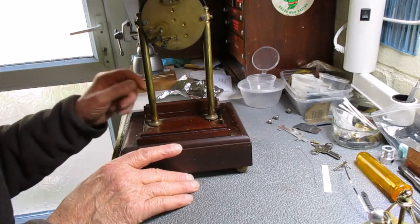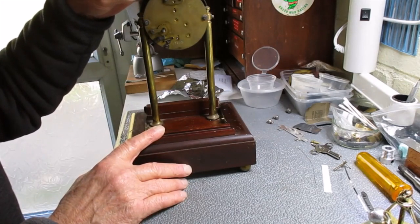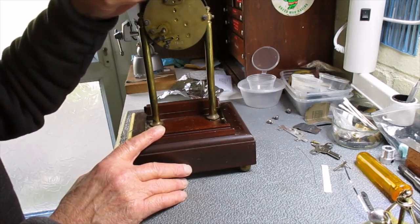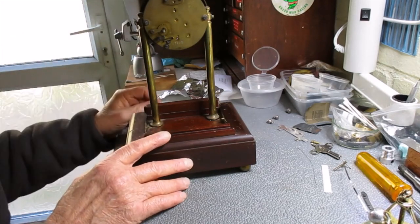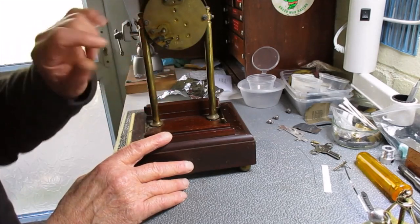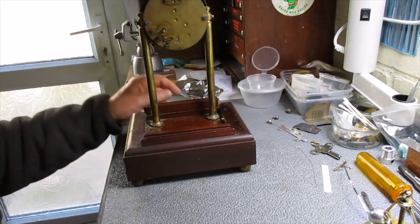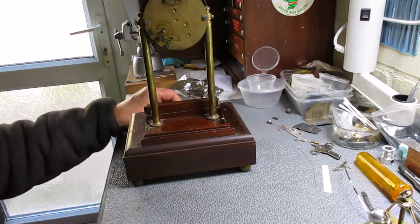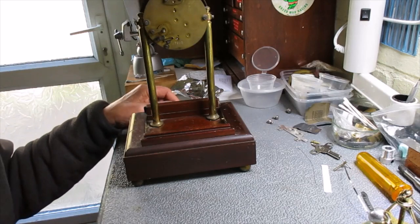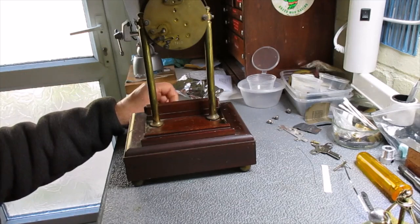It's very slightly unusual compared to other torsion clocks in that to set the beat on this, it's got a friction fit pin to anchor arbor. It's a very nice clock. I have one in a glass dome — same movement, just in a glass dome. I don't think this has been touched for a long while considering how dirty it is in there, but the escape wheel does trip quite nicely. The anchor is in the saddle, so that needs to be set up once it's all back together to get the locks and drops right. The screws will need polishing up and rebluing because they're a bit rusty. Apart from that, it's all fairly sound, so I'm going to get it stripped out.